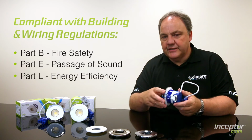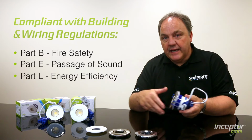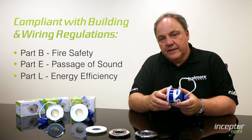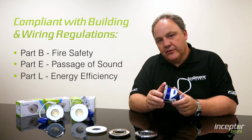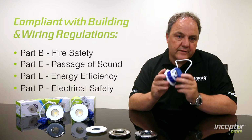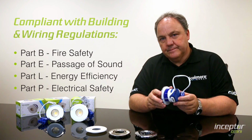Part L is about energy efficiency and heat gain or heat loss. Installing these will not affect that, especially using the insulation support bracket, pushing the insulation out of the way. And Part P is concerned with electrical safety, and it's fully compliant with that.